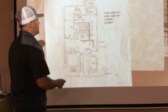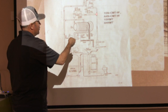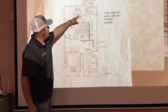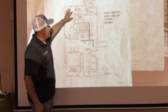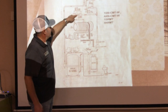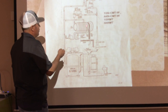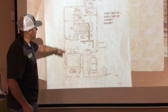Now really pay attention to this. You have two options where the liquid refrigerant can go. Leaving the electrical diagram context — the refrigerant can go through the cylinder solenoid, letting high-pressure, high-temperature liquid come through an AXV set at 15 pounds for 404A. It goes through our cylinder evaporator: throttling takes place, the remaining liquid evaporates, we reach the saturation point of vapor, start superheating, and return to the suction line back to the compressor. That's one option.